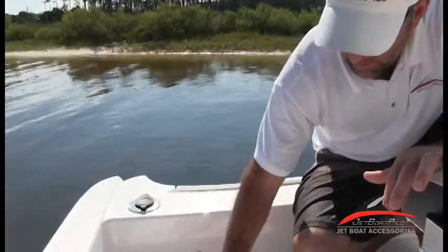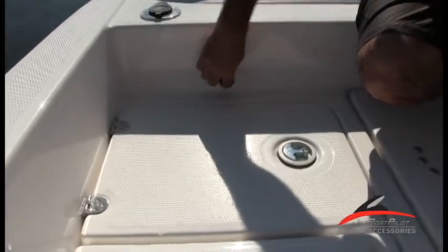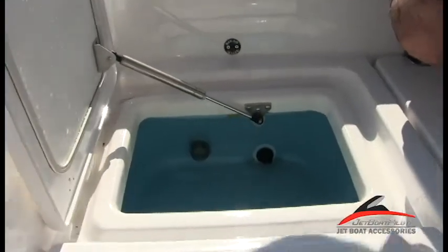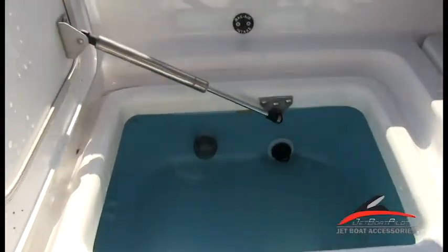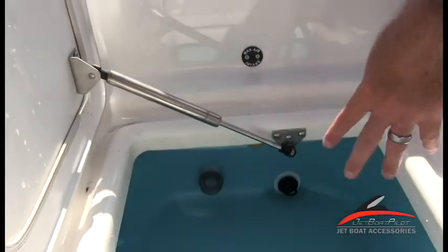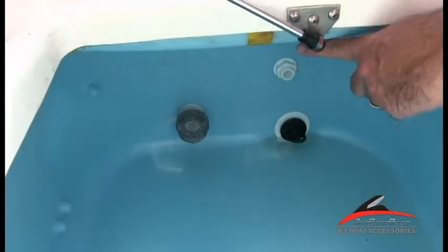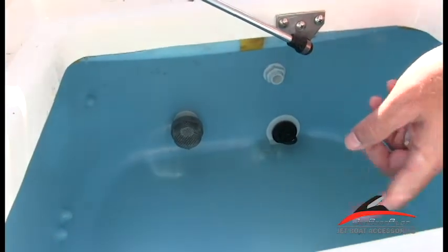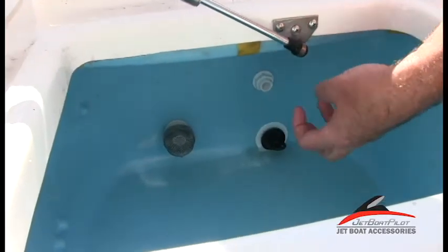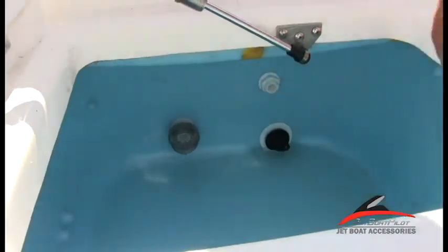We are on the starboard side of the boat in the rear. Notice we've got a little max air intake here — this is ventilation for our live well as it's filling itself; it needs to have a way to breathe. Notice you've got a stainless steel strut here, really nice for salt water guys. We've got a drain plug in the bottom and a screen. As water is pumped in, it also runs additional water with the aerator into the system, always exchanging old water with new water. You have to have a filter bringing it in and a filter pushing it back out again.